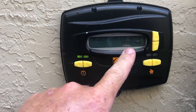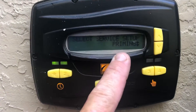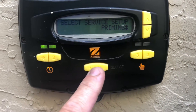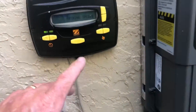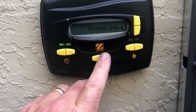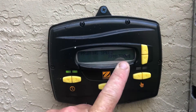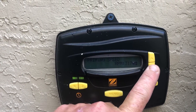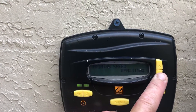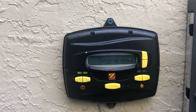You're going to go ahead and you're going to see where it says priming. You can actually select your priming. Anytime you want to enter into a selection, you go ahead and hit your menu button — that's the select button as well. The priming speed is how much speed the pump is pulling in revolutions. We have it set here at 3,200. If you want a little bit lower, you can go ahead and set that. We're going to lower it down to about 3,000 — just hold the down arrow until we get there. Go ahead and press select to lock that in.